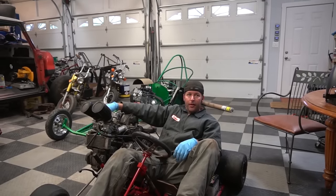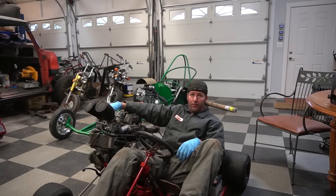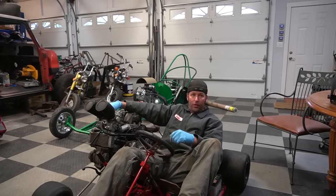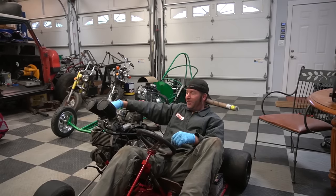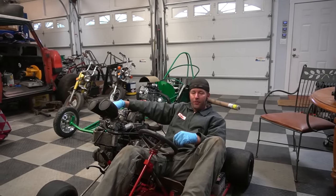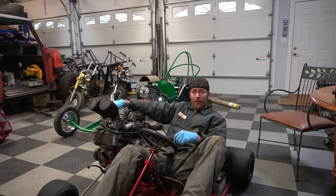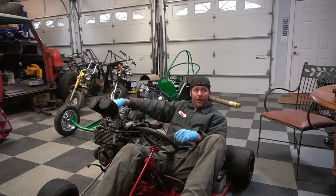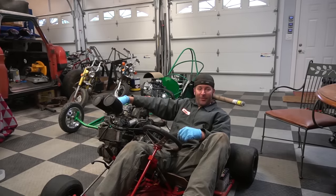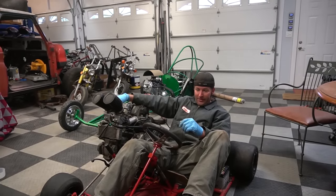And the head bolts weren't tight. We noticed that it started when we were fixing the clutch basket. I noticed all this oil all over the place. Then I went to go tighten up head bolts, thinking, well, I'll just tighten them up and hopefully the leak will go away. They weren't even tight. They were finger tight. And we'd run it at the drag strip the way it was. I'm surprised we didn't blow a head gasket. Yeah. So it's like someone began taking this engine apart and then they just said, forget about it.